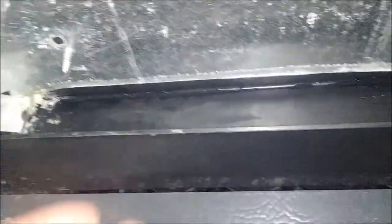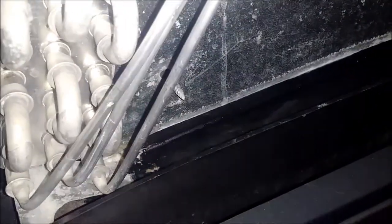You might have to run your AC unit for a little while so water builds up and you can see where it's dripping through. One way to know your pan is leaking is if it's wet below near the furnace fan. Another way: if you have a drain hose and you do not see water coming out of it as the AC runs, there's a good chance your pan has a crack.